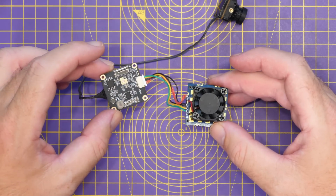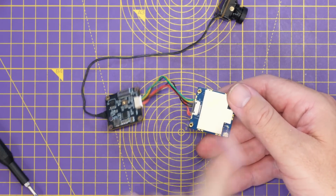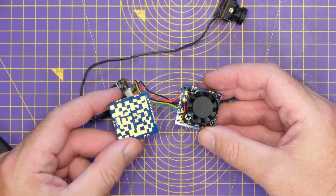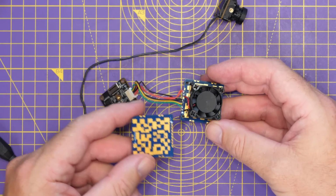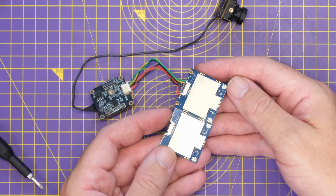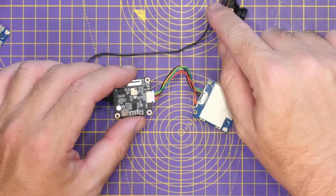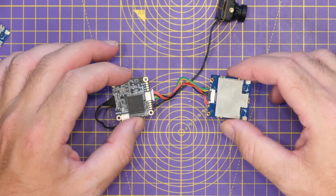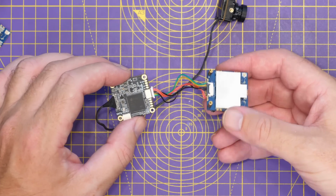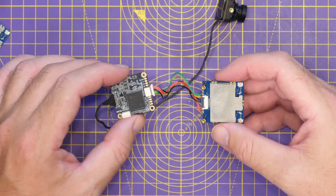Now, I've just separated the boards to give you a closer look at them in more detail. What you will notice, first of all, is that they're different colours. And actually, something I've noticed is this top Wi-Fi board doesn't appear to actually be designed by Runcam. I was looking on AliExpress and I'd already ordered these, and it turns out the Wi-Fi board is this board here. It is literally this board that I ordered from AliExpress for my custom OpenIPC build, and that is what they have used in this board setup. So what it looks like is Runcam have designed the camera and the main processing board and have chosen an off-the-shelf Wi-Fi board for this build. That is partly because it's probably easier for them to do it this way. This is still somewhat of a test product, but that also explains why it's a little bit of a clunky setup.